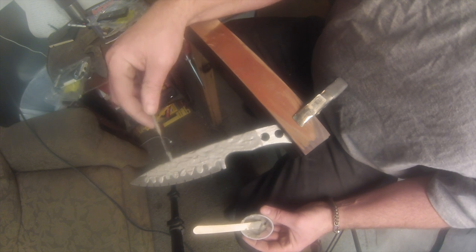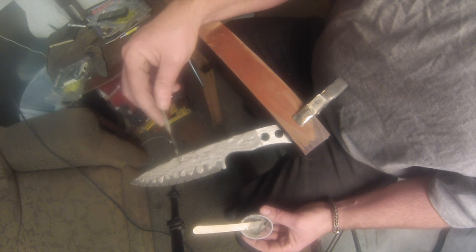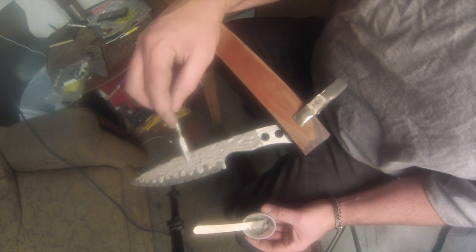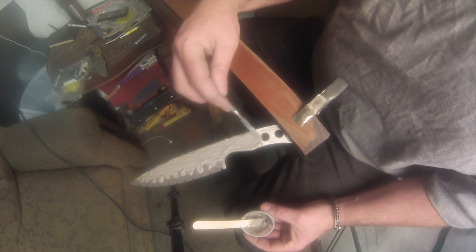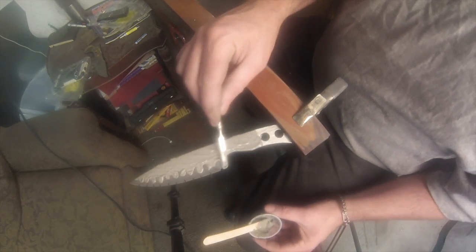Some people do thinner fingers. I kind of do fat fingers. I don't like what I call the clown Hamon, but sometimes I get that because I do this where it looks like a big wavy, big fat lines up and down and up and down. I don't care for that. Usually I don't get that if I do the heat treat in the oven right.